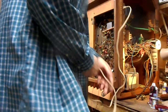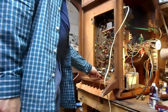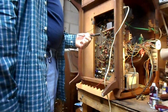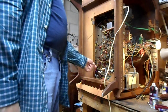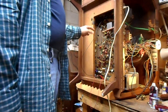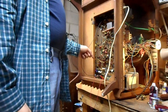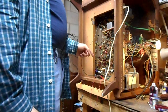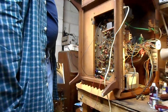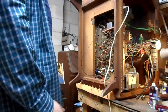Now we can power it up. What I'm going to do is slightly dangerous. I have this 68 microfarad 450 volt lytic here. I've got nice polarized wires hooked up to it. The negative on it's grounded. What I'm going to do is jump its positive to the positive of each can lytic that has its negative tied to chassis, and I'm going to observe.